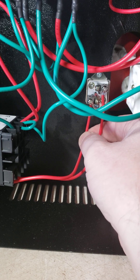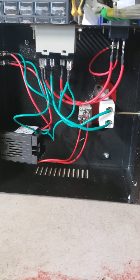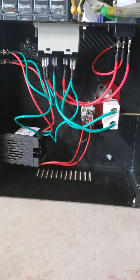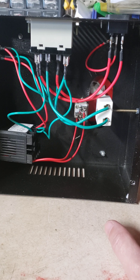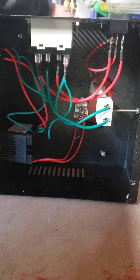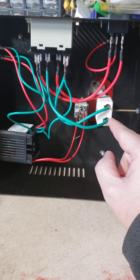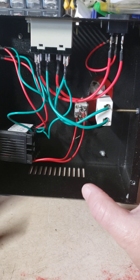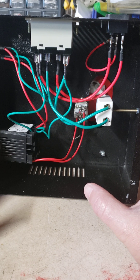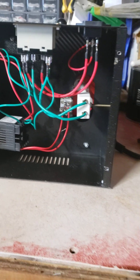One other thing I want to point out while I have this open: if for some reason you started heating it up and got any kind of temperature going and then get the 4H code, you want to let this cool down. Not only is the red chamber up here going to be hot, but these two wires which are your heating coil — there's a very good possibility those will also be hot. So if you're in the middle of going up in temperature and you get the 4H's, let your furnace cool down. It's very important not to work on it while it's still hot.